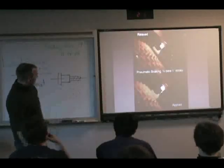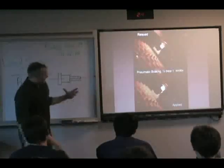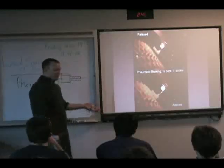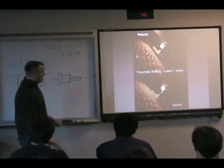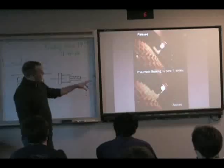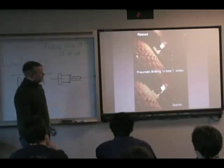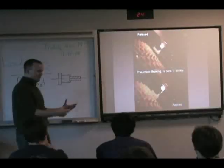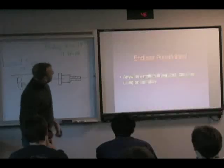This one was really interesting, a braking mechanism. So they actually have a physical brake that prevents them from being pushed or prevents their wheels from turning. Maybe once you get into it, you find that you're getting pushed around and you wish that your design couldn't be back driven. A pneumatic brake, just applying pressure to that wheel, is going to prevent it from spinning, which might help you either prevent being pushed or keep yourself stationary while you're trying to move your apparatus around.